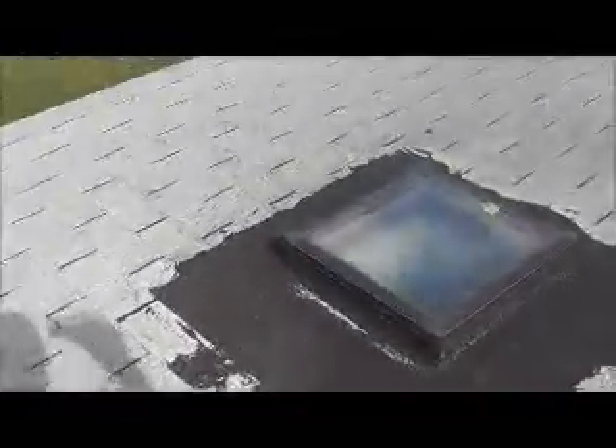We're gonna have to pull this roof because there's holes in it, and we'll need to take it all the way up to the transition. Somebody tried to caulk this too and it didn't work. I'm either gonna ice-and-water shield it and put new shingles back, or do a flat roof — one of the two has got to be done.